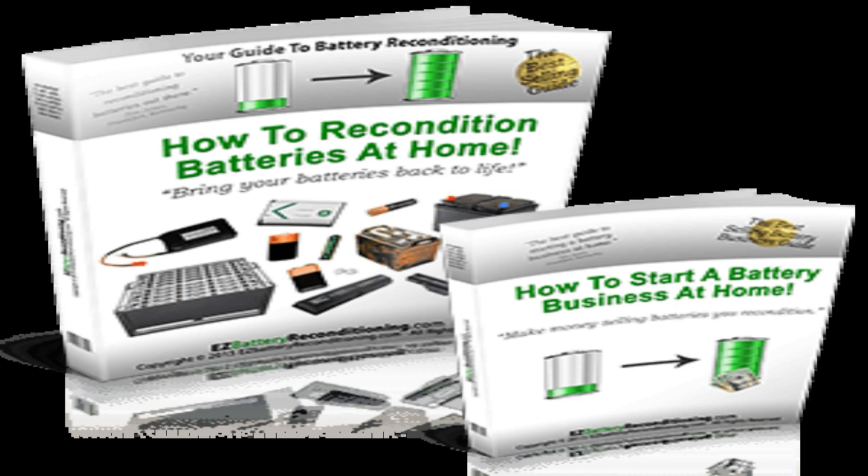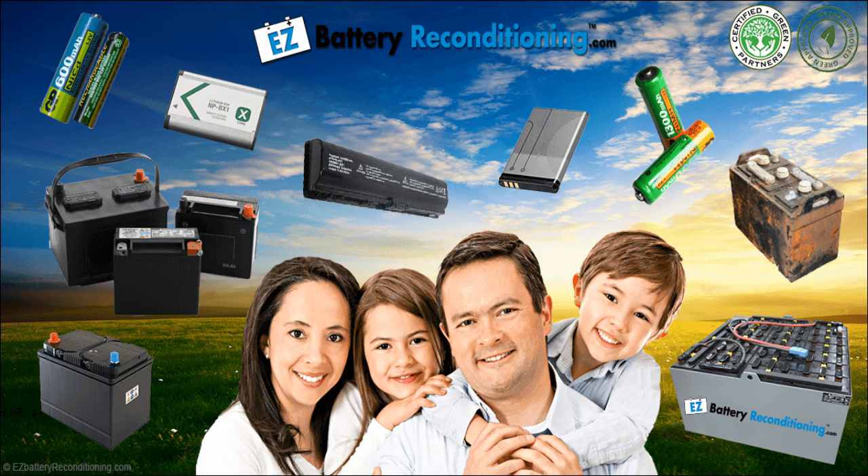Flooded lead acid batteries (FLA) versus sealed lead acid batteries (SLA). One of the reasons some people favor SLAs is because they require little maintenance — unlike FLAs that need to be checked regularly for water level, SLAs used properly can be left alone. However, sealed lead acid batteries have two big flaws: they are sensitive and wear out quickly. So if you're planning on using your solar panel or wind power system every day, this will eventually pose a problem. Here are the categories of flooded lead acid batteries that are best for an off-grid power system.